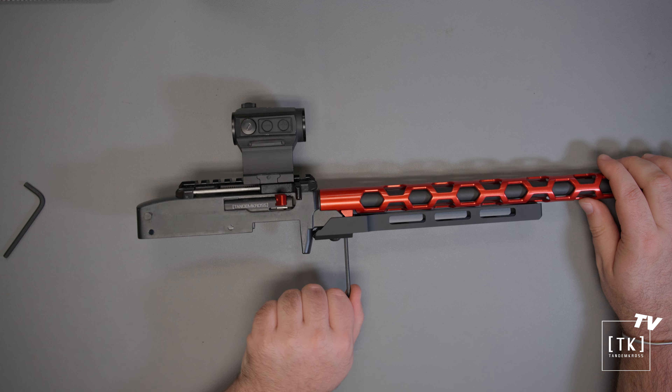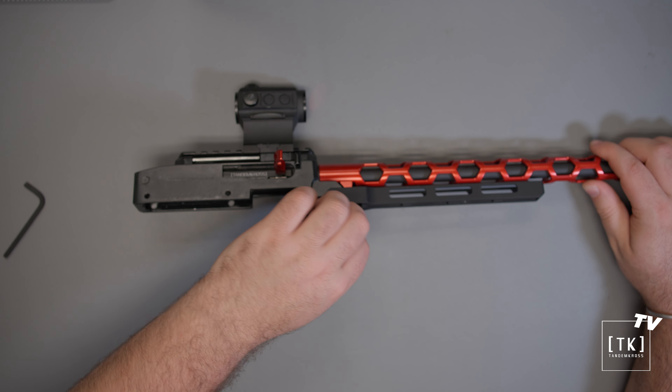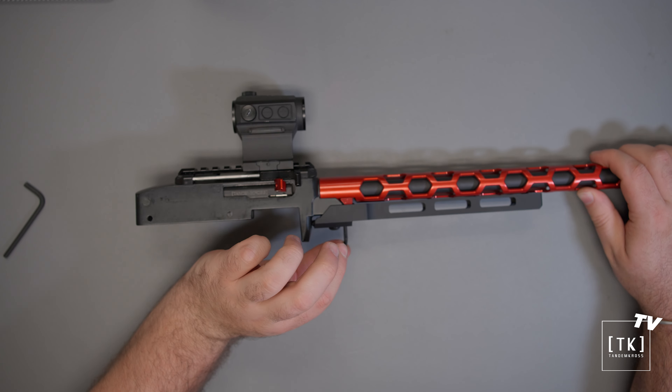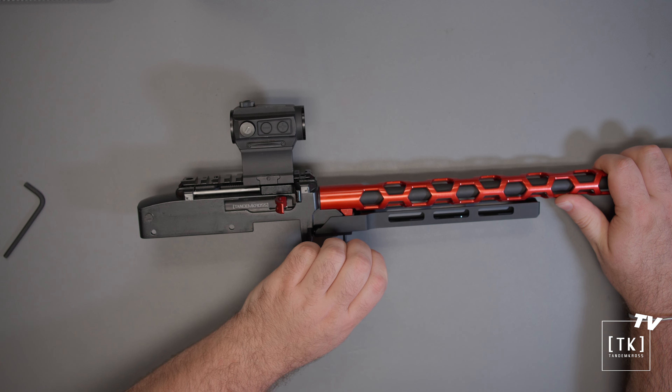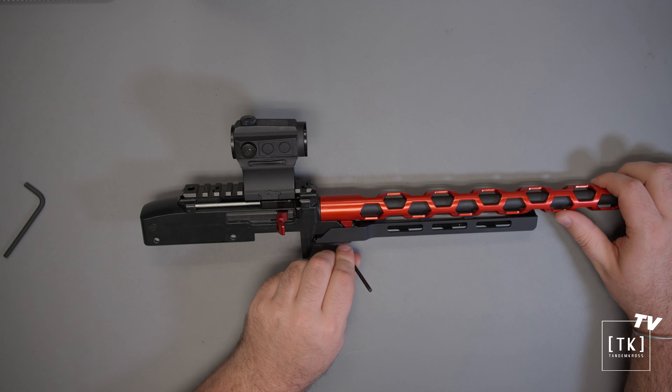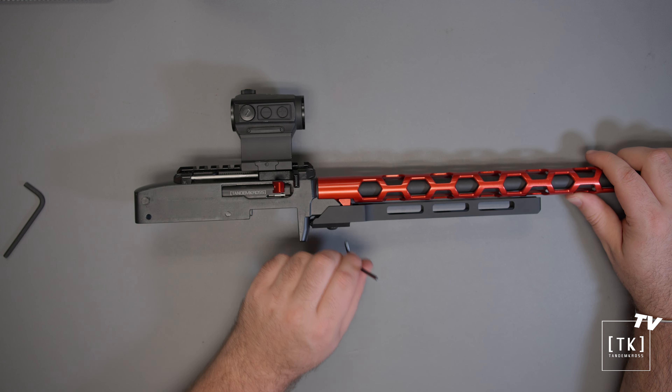In this case, it was really quite close, so what I'll go ahead and do is just tweak it a little bit more — need the long length allen key. We'll just tighten that in, and you can see the hand guard sort of tilting away so that the hand guard is approximately parallel with the bore axis. And that's looking really good.